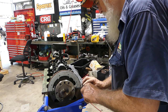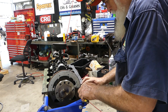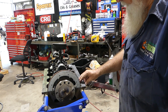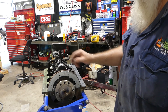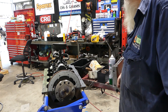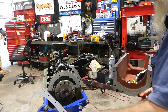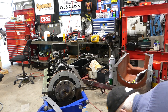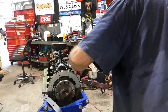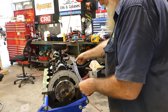So it just bumps up against it. I probably should have done this before. If we push this in there so that lines up perfectly, I do put a bit of extra aviation contact cement around that surface and up the front here - that's all lining up nicely. I'll put this gasket in place; it doesn't hurt if you let this sit for a bit and let the aviation get a bit tacky - that's fine.